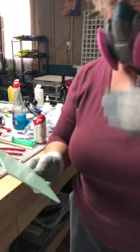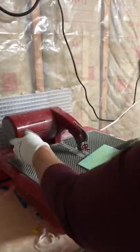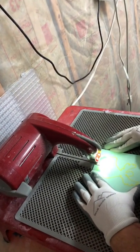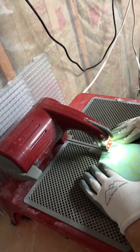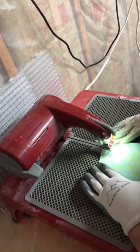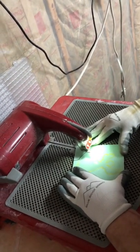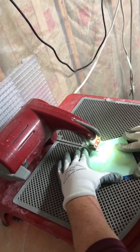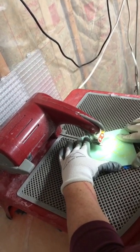The diamond saw has a diamond blade to cut through the glass. You have to very slowly and carefully move the blade around the outline of the drawing on the surface of the glass. If you move too quickly or press too hard, you will not only damage the diamond blade but also get very jagged edges. The glass could also snap, or you could snap the blade from the saw. This is a very careful and slow process.